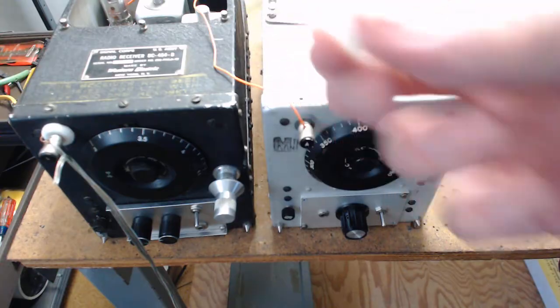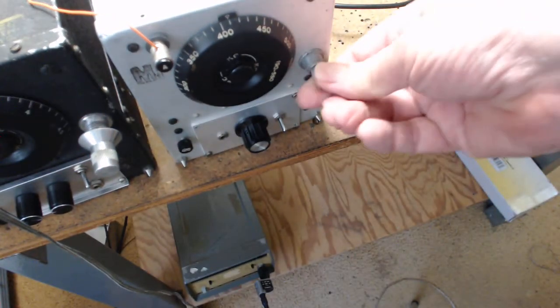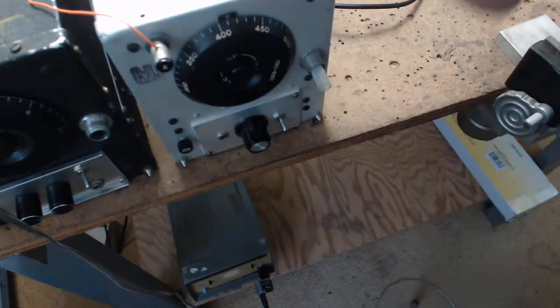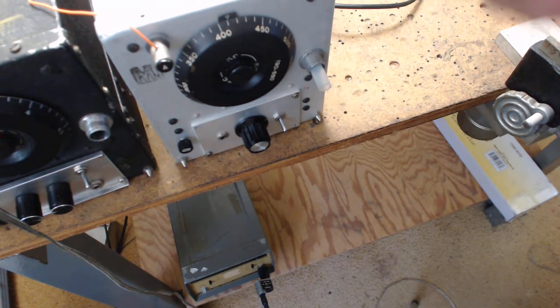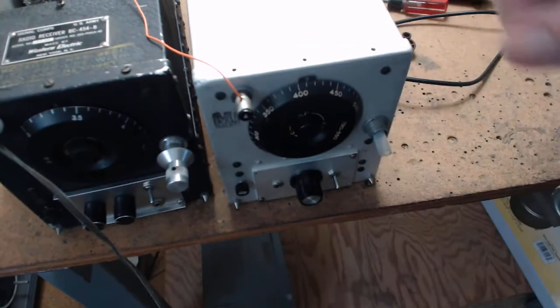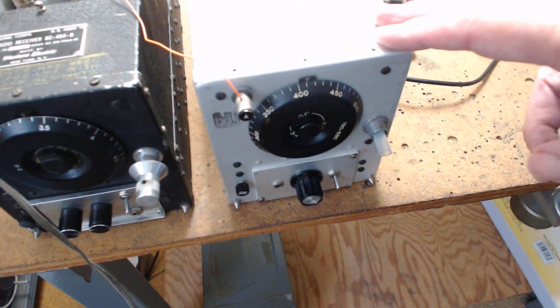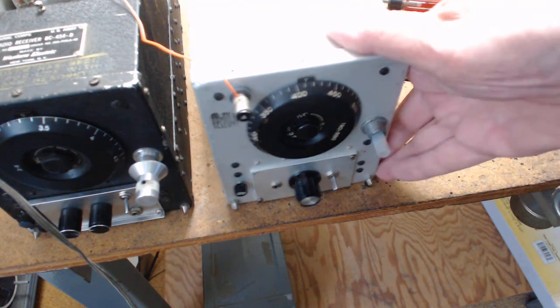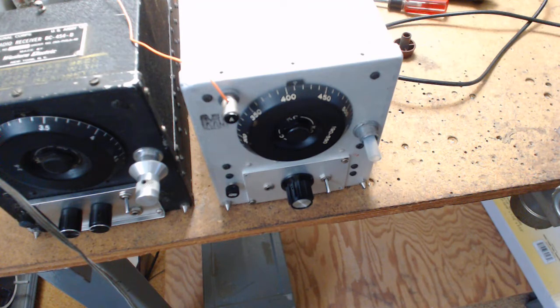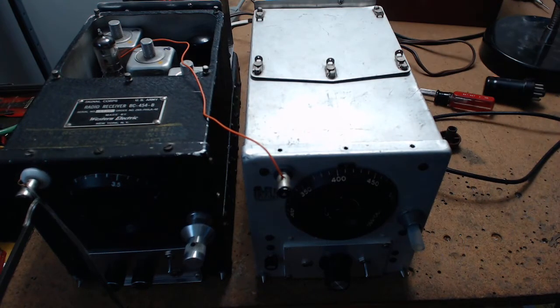Here's a piece of ice maker tubing for a refrigerator - it fits on the spline nice and tight, so now you can tune the dial. In this case it has a quarter-inch shaft that goes into a knob to make a custom knob, because the original knobs for these radios - they call it the local knob - are over $50. I can get one of these radios up and running for about $40 myself, getting the caps off eBay to recap it.